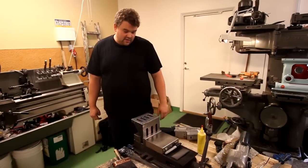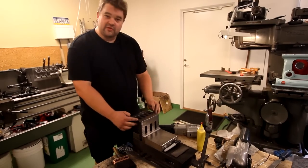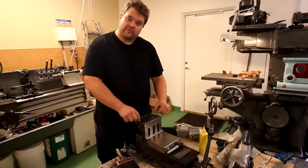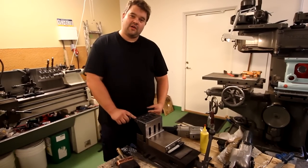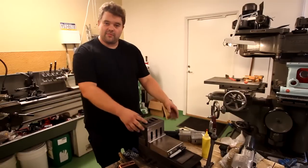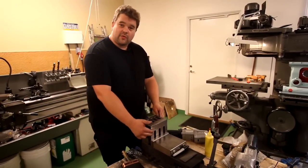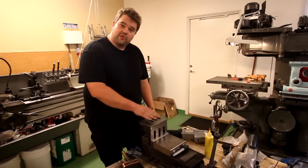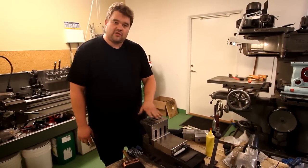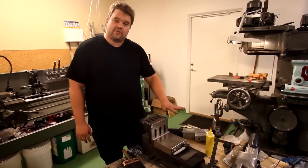It wasn't 90 degrees, so I had to step scrape it, making lines and doing it 1, 2, 3, 4, 5 times, until I get it flat, and check it on the surface plate every time. Now it's quite at the right angle, so now I'm roughing the blue spots so I can get a better pattern and get it flatter.